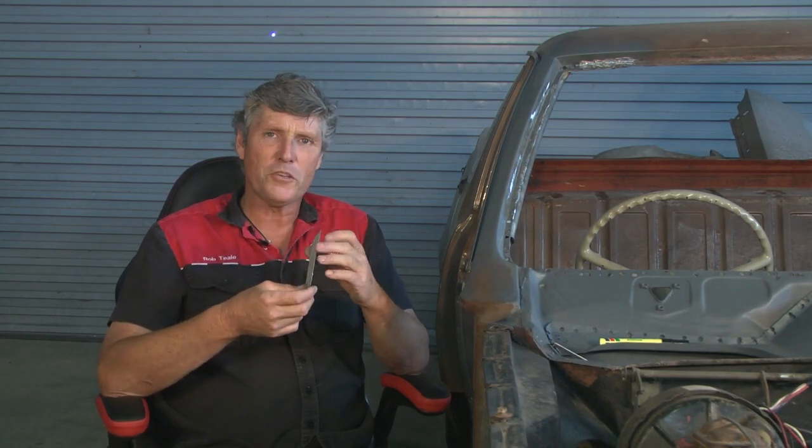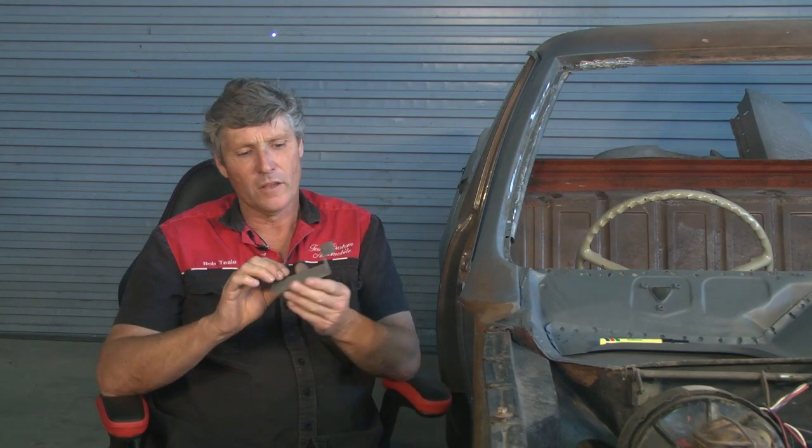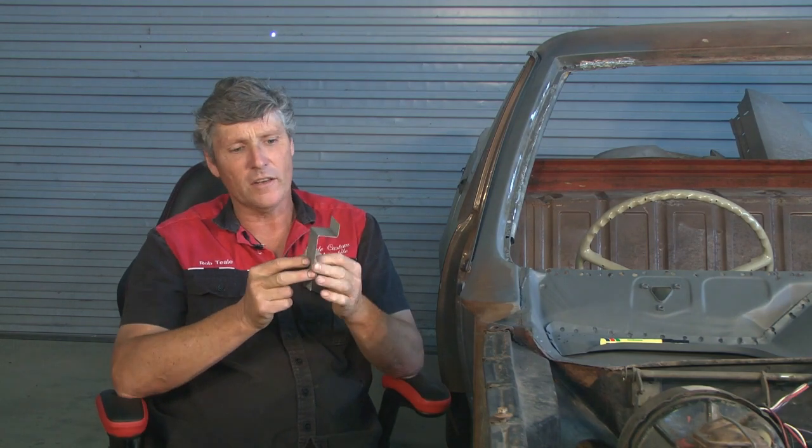Everything we do to introduce shape into a flat piece of metal involves one or both of two things, shrinking and stretching. So today I'm going to talk entirely about shrinking and stretching. Now I know a few of you are thinking that I can always fold a piece of metal, that's not shrinking or stretching, but it actually is. If we look at a fold more closely, this face has shrunk, this face has stretched. So once again, the fold is just shrinking and stretching.